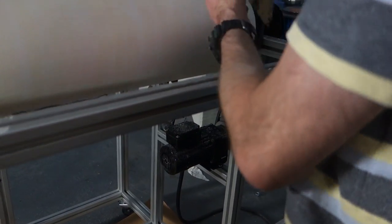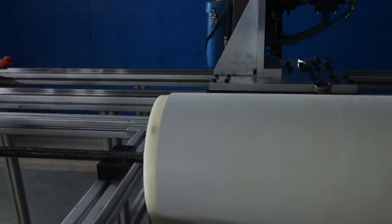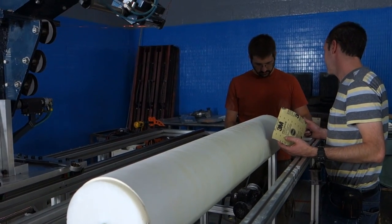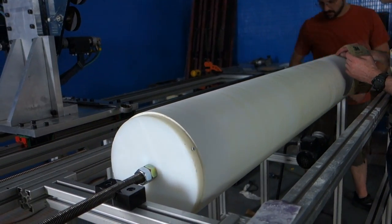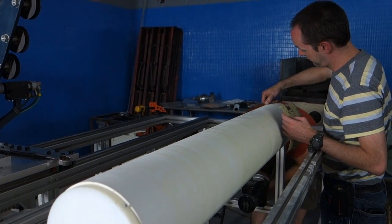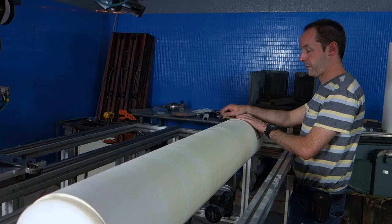Clear. Dropping down a speed doesn't help because it doesn't change our coefficient. In fact, it was definitely better at the higher speed. That's surprising. No, because it's the slippage of the belt. Our coefficient of friction of the belt doesn't change. Our mechanical advantage does, but our coefficient of friction doesn't. We just nudge this guy up a little bit. In there.